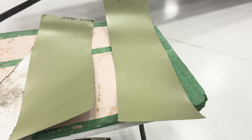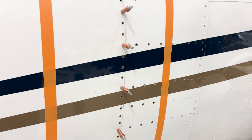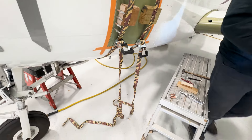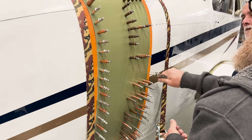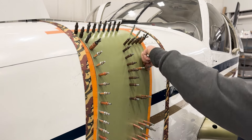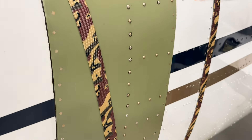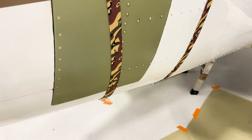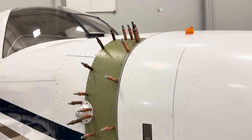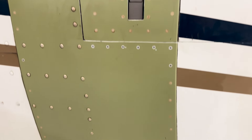So what exactly are ice shields? They're placed on the forward part of the fuselage, just right behind the nose of the aircraft. This also happens to be right in line with the propellers. Part of the anti-icing systems of the Baron 58 are hot props, which essentially melts ice that's building up on the propellers. Since the propellers are spinning at a very high rate of speed, the centrifugal force can sling the ice right into the fuselage. So if the ice is large enough and it hits hard enough, it can leave dents in the fuselage. Essentially the ice shields provide a thicker bit of aluminum and some extra protection against dents from slinging ice.